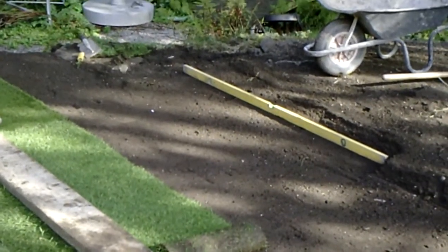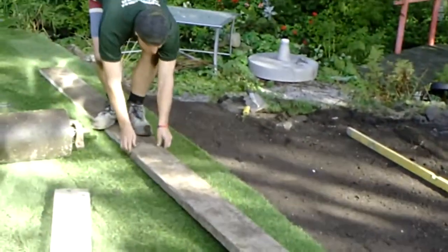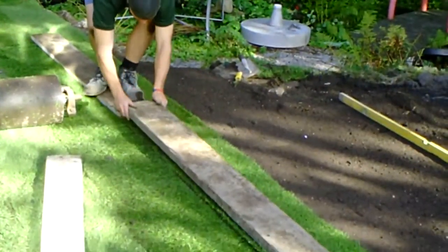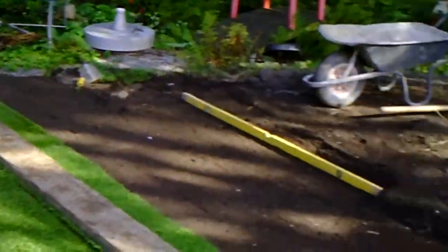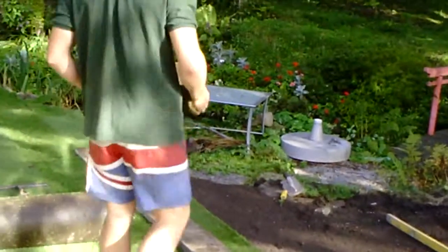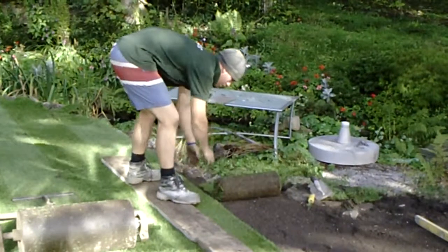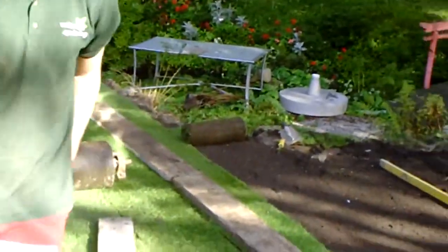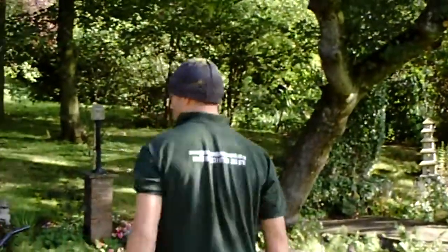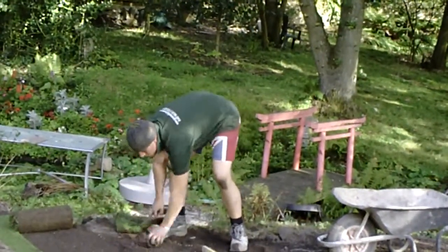The site was blinded with topsoil first, then raked, leveled, and pulled off with a straight edge. Mitchell's now moving over the boards, which is flattening the last area he's just stood on and laid. Now he's going back to get another piece of turf and start the whole process all over again, bringing it straight up to the other edge of the turf, ready to roll out.